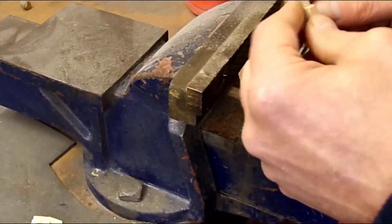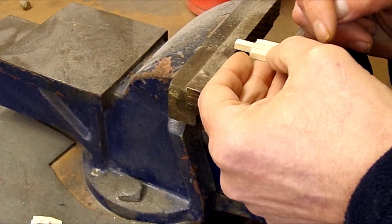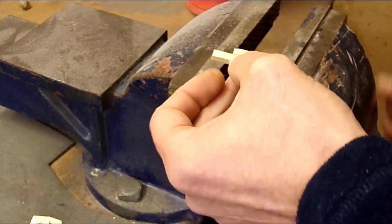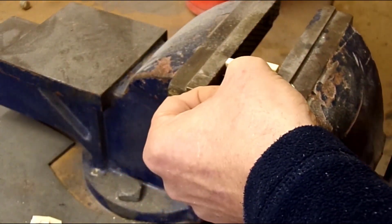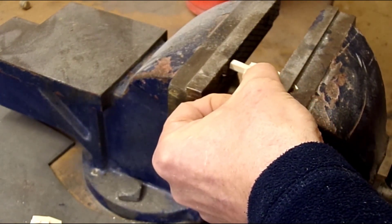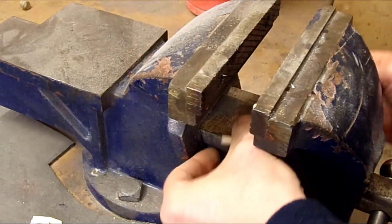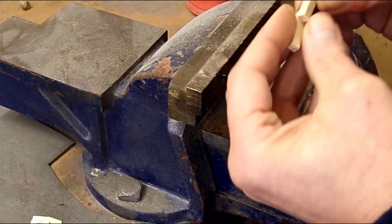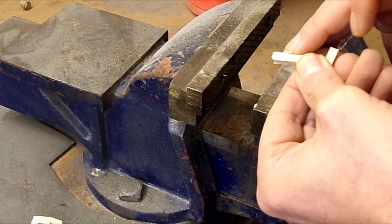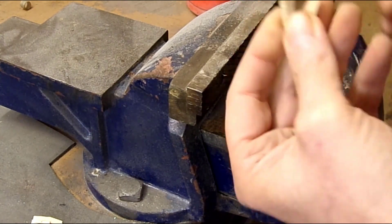This is where the glue was applied, cured, and then fresh glue was put on to bond these items together - so it's onto effectively untreated, cured resin. There we go - that has failed on the joints. You can see it's actually got the glossy section where it was done. Failure. I anticipated that being a failure. So just to see what happens, I've made up three of these. Here's another one - nope, that's failed on the glue joint already. And so's that one. So two out of three failed along the glue line.